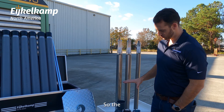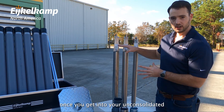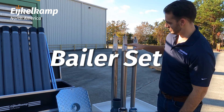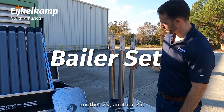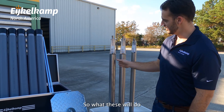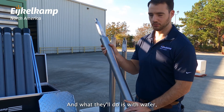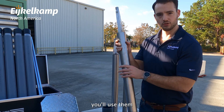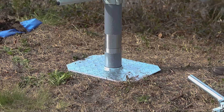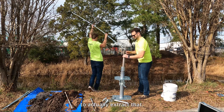The name of the kit is the baler kit — it's a key part. What helps advance it once you get into unconsolidated or nearly fluidized geology is the baler set. We have three 75 centimeter lengths: one with a diameter of 63 millimeters and one of 50 millimeters. When you get to the bottom of your hole, they can extend a little bit below the casing. You move them up and down with water to fluidize that sand layer or collapsing layer, collecting material inside and extracting it.